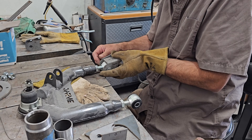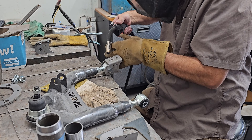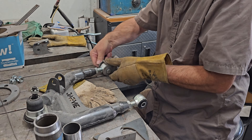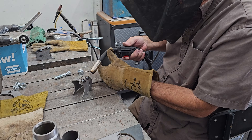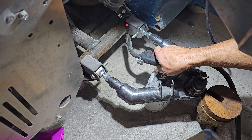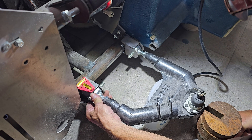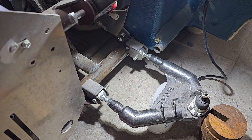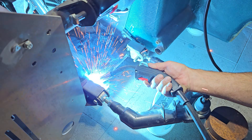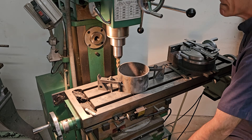I'm going to put those together on the piece itself to actually get the spacing perfectly spaced out. These bushings have a little metal pin and that's what actually gets bolted to it. Then this bushing is the part that does the rotating — hopefully it never actually rotates, but it just flexes in rotation. So with these bolted in place they are spaced perfectly, and then we'll take the whole assembly out after we've welded it and put it onto the chassis in exactly the position it's going to go. This whole setup is adjusted on the length of the A-arm and where the pickup point is put on the chassis, but there are some adjustments in those bushings that you can thread in and out to give you some of your angle to set up.